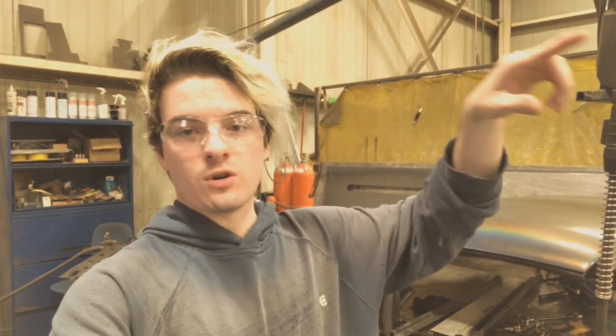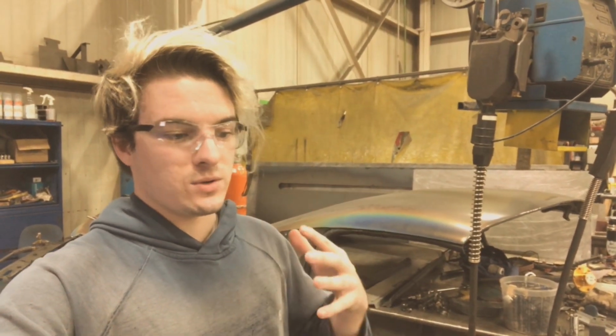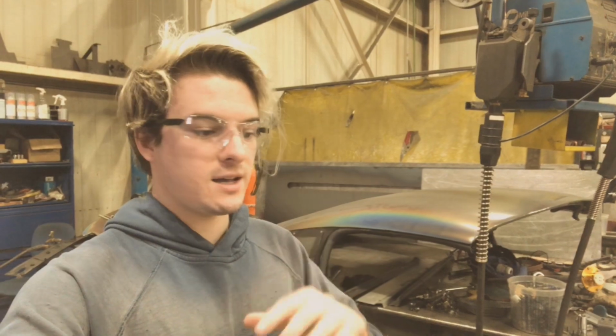The only other thing that is more complicated would be the tubes going along from the top corner of the main hoop along the door frame all the way to the front blocks that are currently already tacked in. And apart from that, it's just measure the gaps, cut the tube about 1.5 inches, like 3/4 inches longer on both sides, so when you go and notch it, they fit up nice, perfect. I don't want these giant gaps. They've got to be nice, tight fitting. I am TIG welding this cage, so I need those gaps to be nice and tight. Obviously they'll be beveled a fair bit.